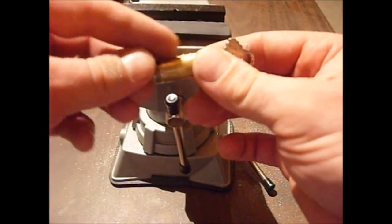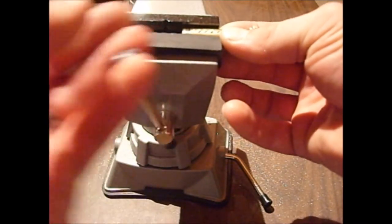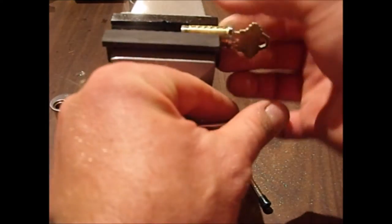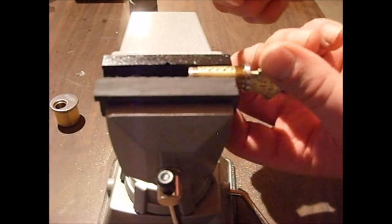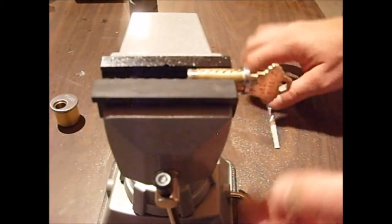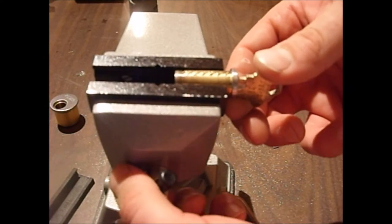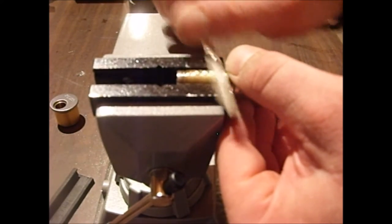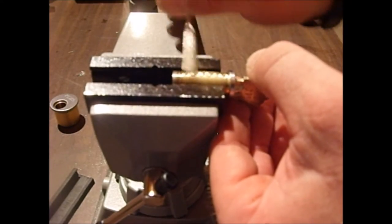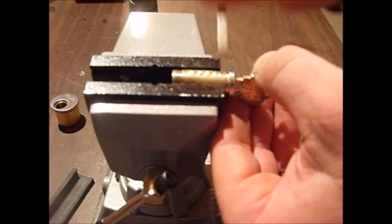This one's actually not too bad - the first one was horrible, but this one's not too bad. You can see those little bumps right over the shear line. So what I do is clamp it up with my vise so the shear line is above that, and then I'll just take my file and make those flush with the shear line. Now you want to be careful because the key will kind of move in there too. You want to make sure you're only taking off enough material to make it flush with the shear line - not below it, because then you'll have to start all over again. And you want to be very careful not to take too much material off the plug itself, because that'll actually make it easier to pick. My buddy Papa Gleb reminded me of that.